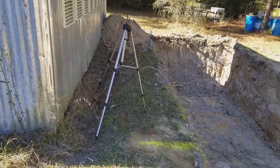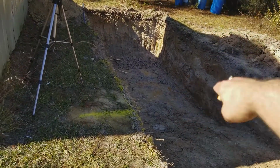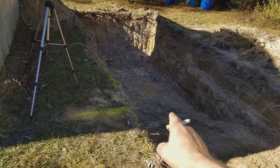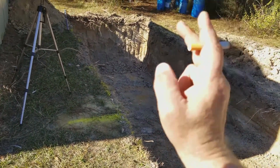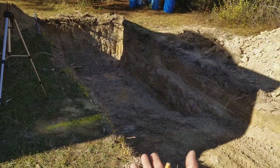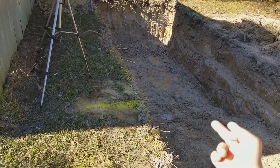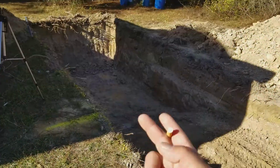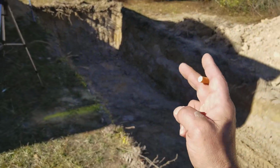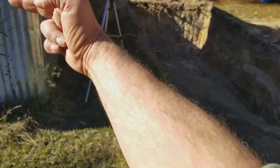What I want to do is pump it into the top layer first and then feed that down into the bottom layer. And then from the bottom layer, right back as a return. So that way it gets the coolest at the top and hopefully the warmest at the bottom. You pump that cool water in that first, shallower layer, and then run it down to the second one and pick up that heat there, and vice versa. When it's hot, you run it through that first one, cool the water down, then run it to the second one, cool it down even more, and then pump it straight from that lower level right into the system.